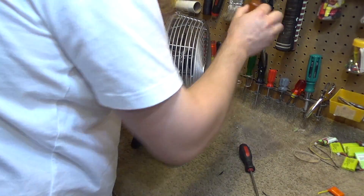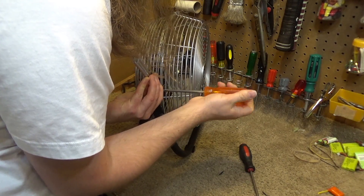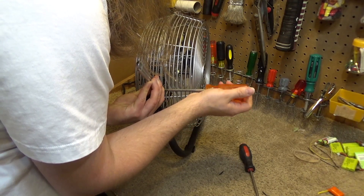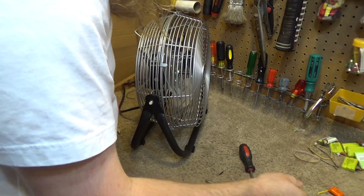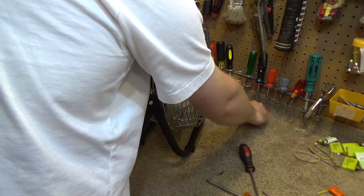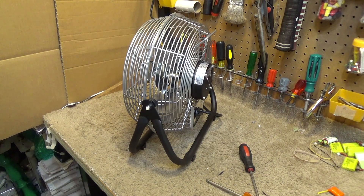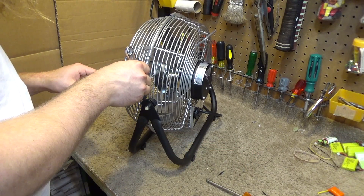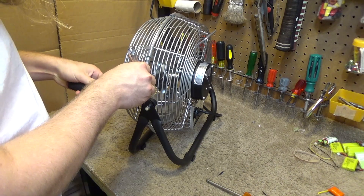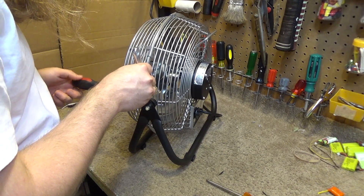I tend to think these motors were not really made specifically for this particular blade set — my speculation is they're more of a generic motor. When it comes to matching motors to blades, like in a kitchen exhaust fan with a belt-drive scenario and two pulleys, you'd adjust the pulleys to change the surface area the belt rides on, changing the load on the motor to match its rated draw. In this case, we're just over half of the allocated power draw, so I think it's just not enough load on the motor.